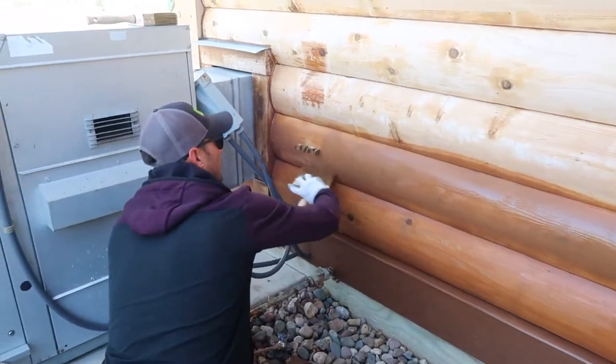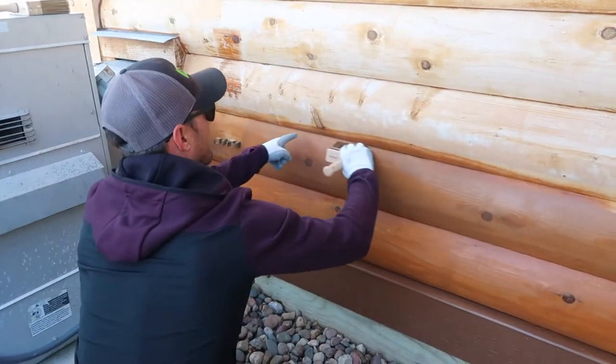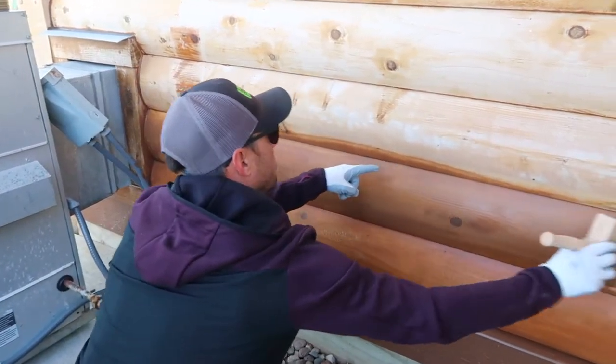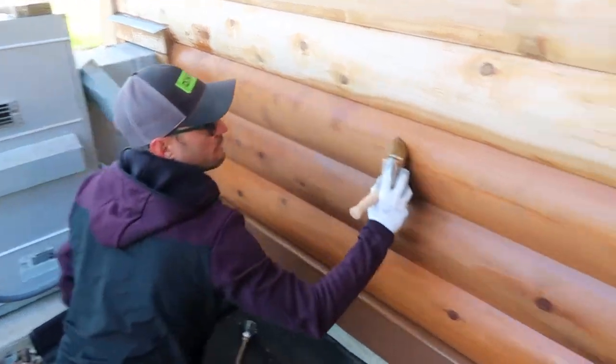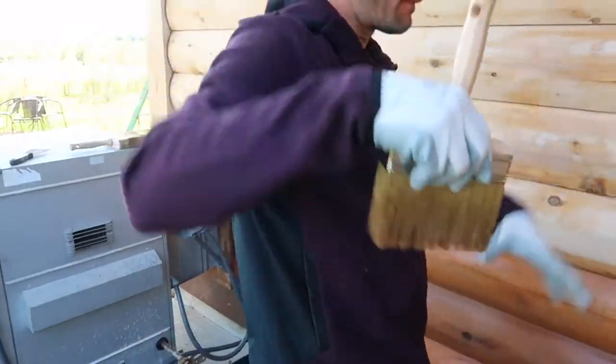Right here I can see I got quite a bit of stain. Grab it from the bottom so it doesn't drip down. This edge — I want to make sure right inside here that this edge gets totally saturated the entire time too. Brush through the work and be gentle with the brush. You want all these bristles to be nice and in order, not all fluffed out.